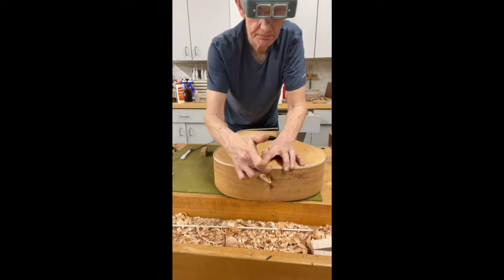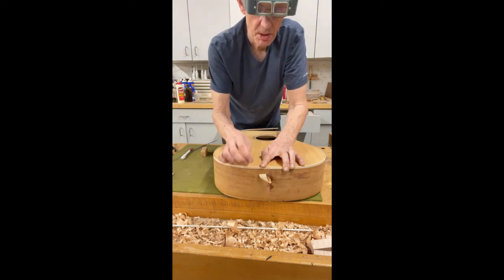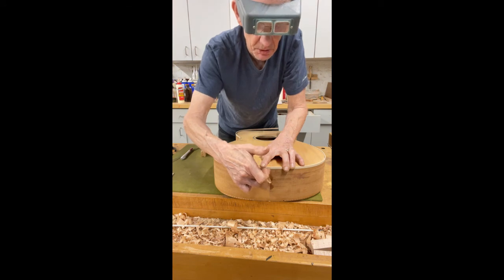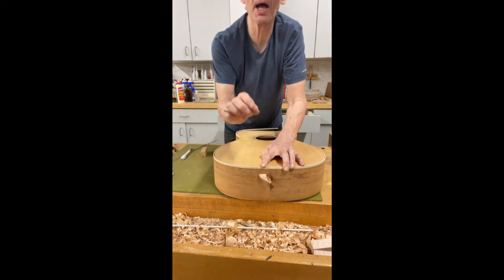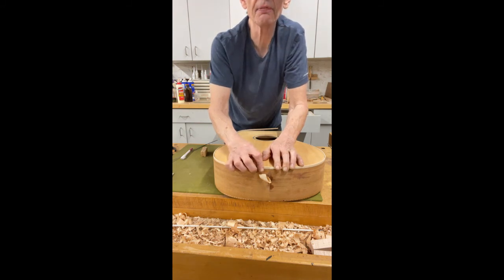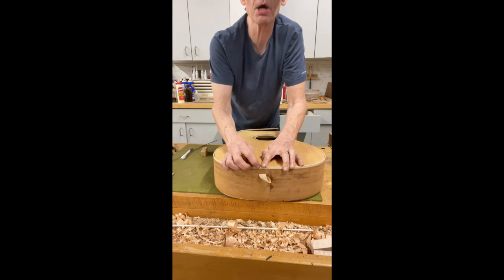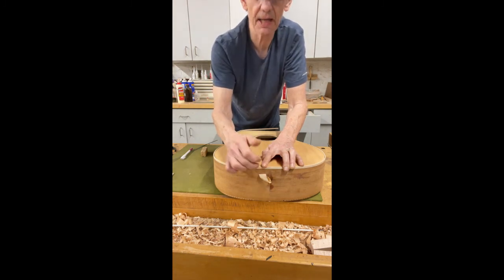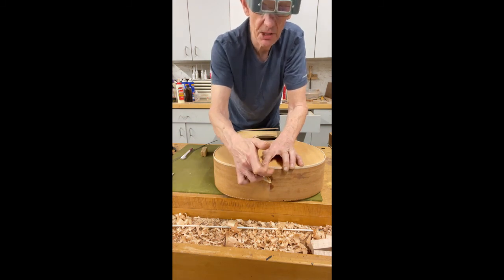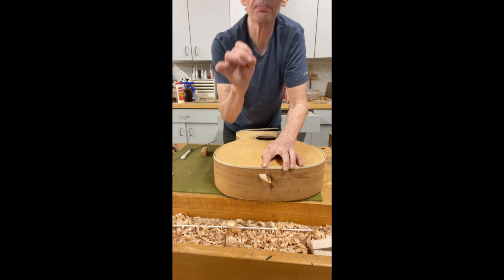Take your time in making this as perfect as you can. It's more important that these bottom lamination lines line up perfectly, because if they're off, your eye is going to be drawn towards that more than towards maybe just a kind of a sloppy seam here. So make sure, at the very least, you get those little lamination lines lined up perfectly.